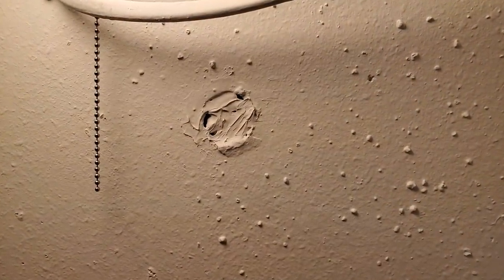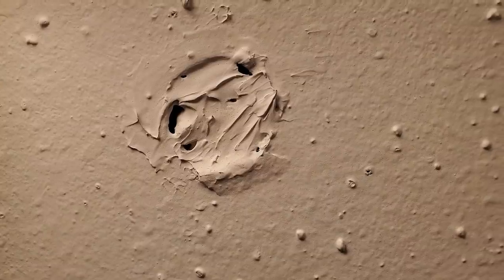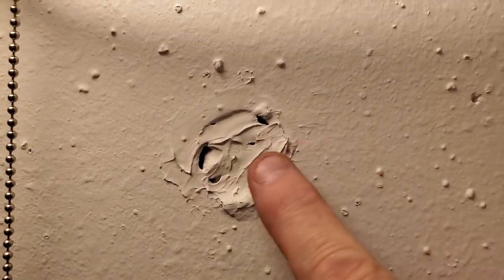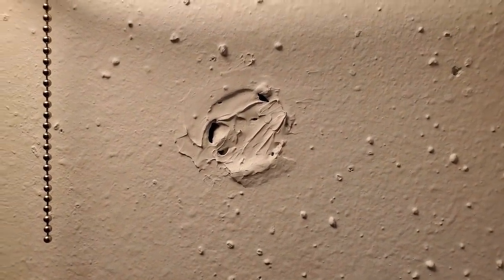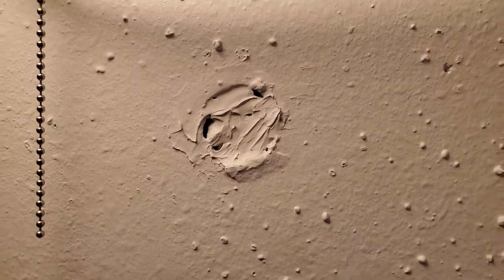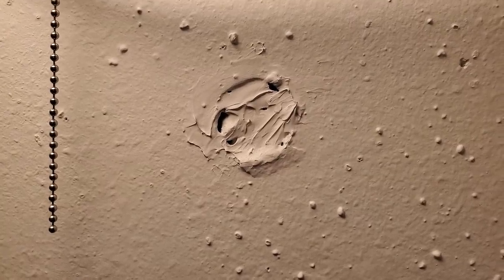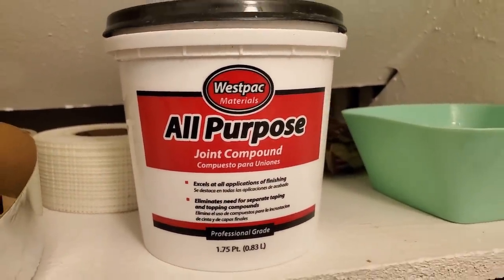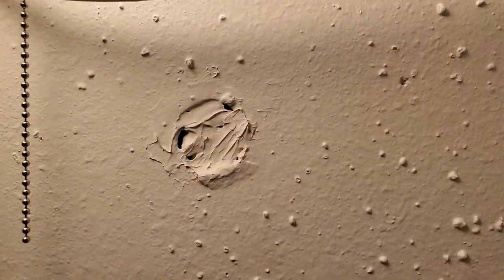A couple weeks ago on our first episode of 'That's Not How It's Done,' I pointed out this lovely patch job in my closet with the amazing electrical work, and how they used caulking compound to fill it in. That one especially bugs me because it's ugly looking and just a reminder that they don't really know what they're doing. One of the things I pulled out of the pod the other day that might help is my all-purpose joint compound — that's how you fix walls if you're going to do it right. I may just pop that thing out and fix it because it's so easy to do right.